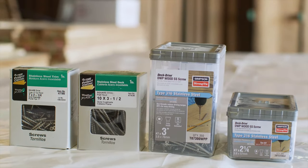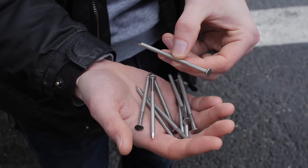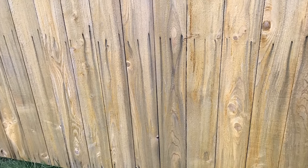When it comes to decking applications, most people are going to use screws or ring-shank or spiral-shank nails. With screws, as long as you are using the type that has a head where the screw bit is not going to walk out of it, there's less danger of the coating coming off. The underlying material is iron, and if the coating comes off — whether by being hit with a hammer or because the bit comes out of the screw head — you wind up with iron in direct contact with the wood. That produces blue-black or black iron stains. The only remedy is to remove the fastener, treat the stained area with a mild oxalic acid solution, and replace the fastener with an approved one.